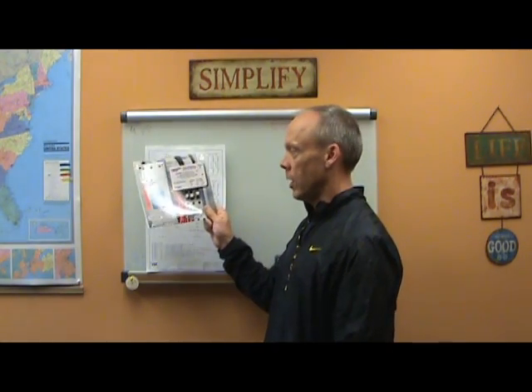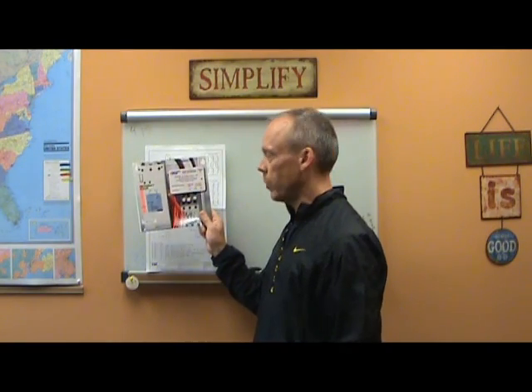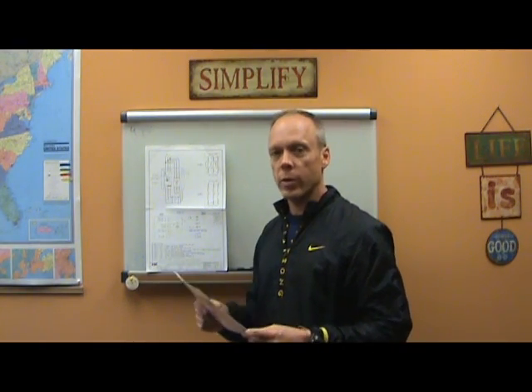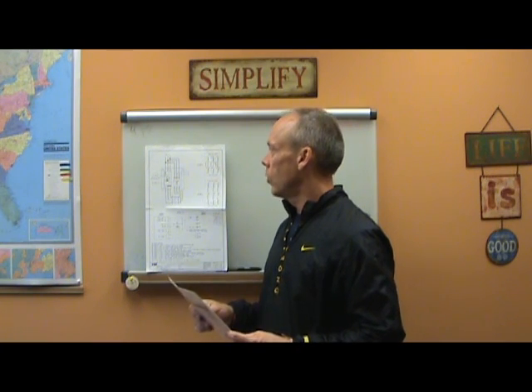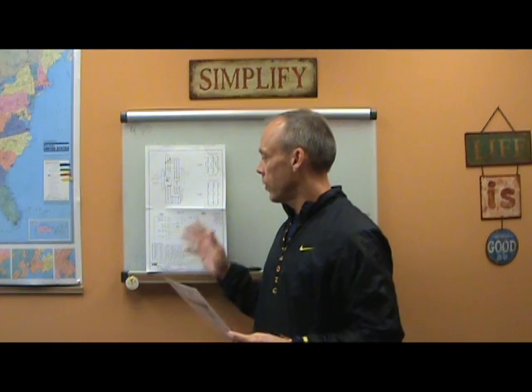The next frame size — we send this one out too. This is 40 horsepower, 208 volt, good up to 40 horsepower, and 480 volt up to 100 horsepower. So if this one won't fit in the existing cabinet, you give us a call and we'll put one in a cabinet for you. We'll put the interface relays in, throw a fuse in for the 120 volt power supply going into it, and give you a nice drawing with it.